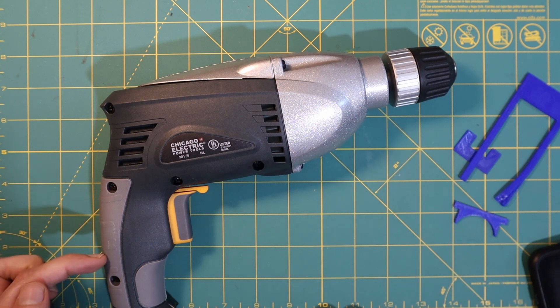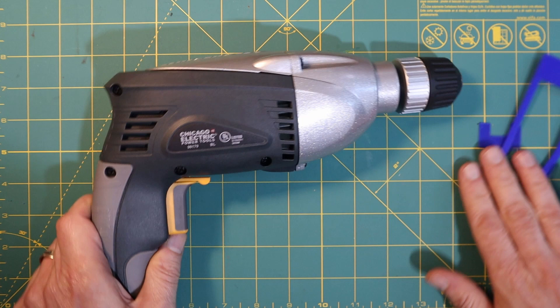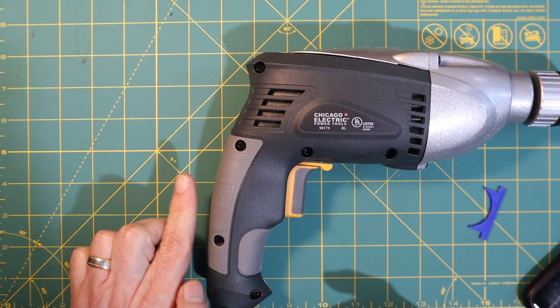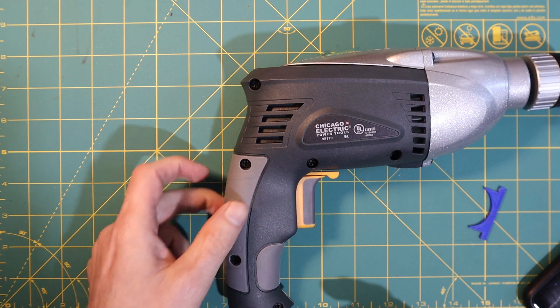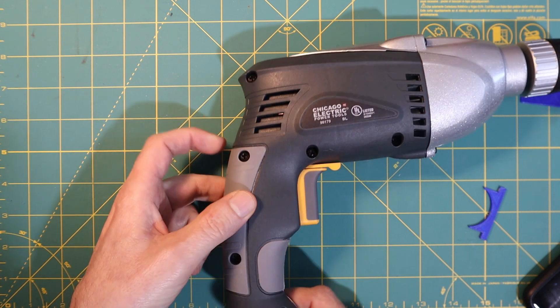The other thing is I wanted to get the curved surface back here. The way I dealt with that is I used a simple protractor. I wanted to get this angle here and this angle, and then basically interpolate in between to get this curve. I also measured this width here.